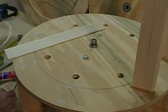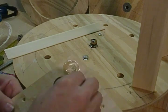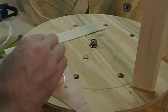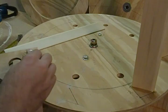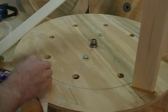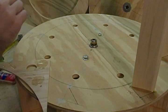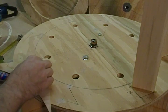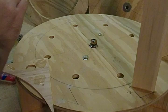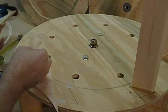I'm using just a five-minute epoxy. I'm going to mix up just enough to do one at a time. We want these really square, so take your time and get these nice and square. I put a pretty generous amount of glue on the backside, and I'm using the 1-2-3 blocks to keep it squared up.